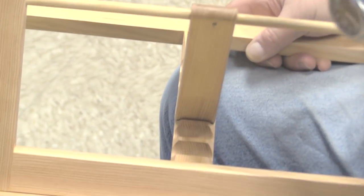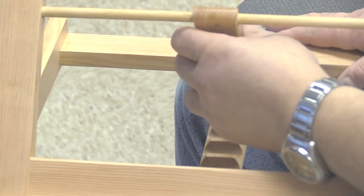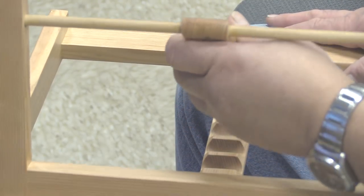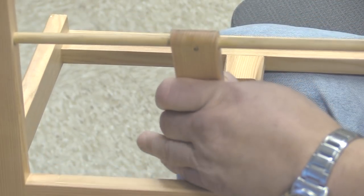The middle piece on that one with the notches in it, I took two pieces of 3/4, put them on the drill press, and drilled right down through the center of it with about a 5/8 drill bit, and then pulled them apart, and that gave me my notch. Did it give you two easels? It gave me two pieces, yeah. So you could do two easels if you wanted to. Again, you could use a square piece and hinge the middle. I just decided to try something different since I was in the midst of this nightmare.